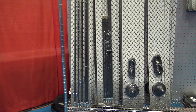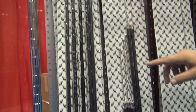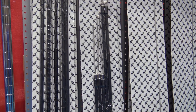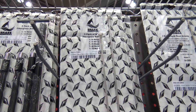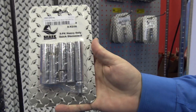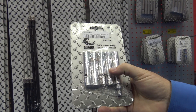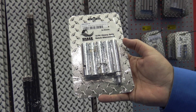That's exactly right. What do you think about the HF sticks lately with people buying them? What are they saying? Well, these have been really popular here. These are the 5-pack of hamsticks, and they've got them in the full size and in the minis, in 10 meters, 15, 20, 40, and 75. We've got another 4-pack that is 10, 20, 40, and 80, and they've been really popular, especially sold in tandem with the 5-pack quick disconnect. So you pop this into your mount right here, add these to the end of your hamsticks, and then you can just wham bam, Bob's your uncle — good to go. You can switch bands at a rest stop.